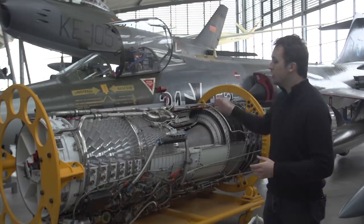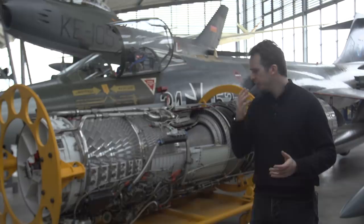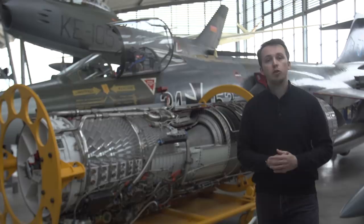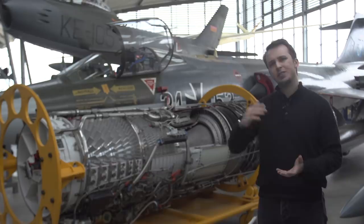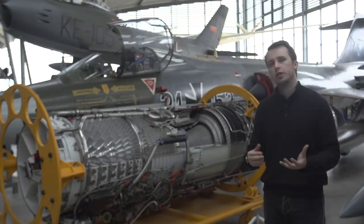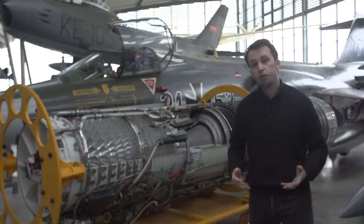The powerhouse of this one was the General Electric J79 — the GE11 and the GE11A, with the difference being the anti-icing system and the front engine frame struts. These engines produce 10,000 pounds of force on military thrust and 15,800 pounds of force on full afterburner. It's a 17-stage axial flow compressor, three-stage turbine with a pressure ratio of 12 to 1. The F-104 is one of the earliest aircraft to use a variable area exhaust nozzle, meaning the rear outlet cone could actually change in diameter. The engine also features an automatic system reducing the chance of a compressor stall by varying the vane angle at the inlet. For the European production of the engine, the engines were also produced locally in Germany, Belgium and Italy.